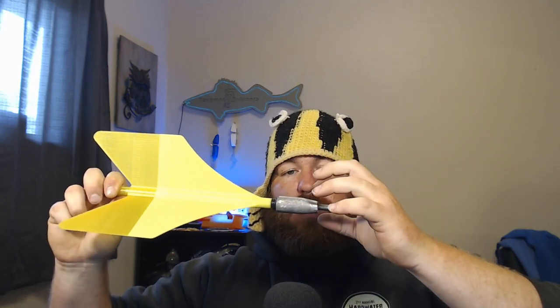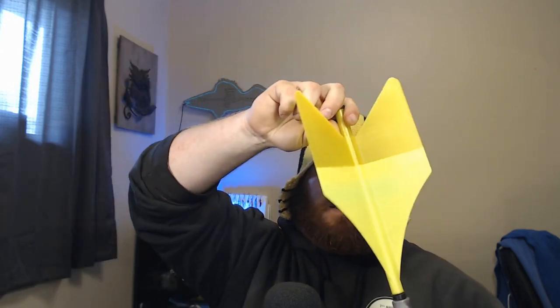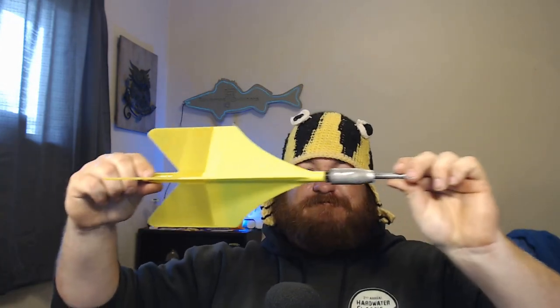There are a few major problems with the design and how it turned out. This lead is actually way too heavy for this design, and the back extends way too much. When I modeled my design and put the PLA in, I just didn't take into account that this would extend almost past the center of gravity on the dart. So what happens is it doesn't have this nice nose-forward flight like I had anticipated — it's more of a straight trajectory. It does work though; you can get it to stick in the ground and be moderately accurate with it.